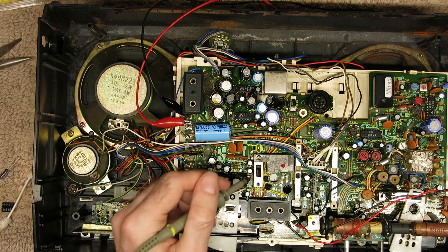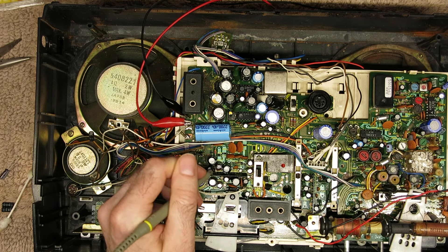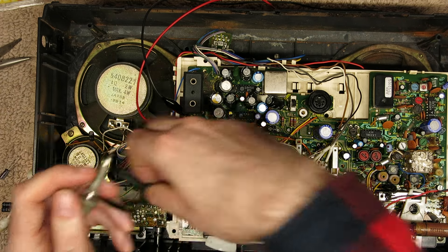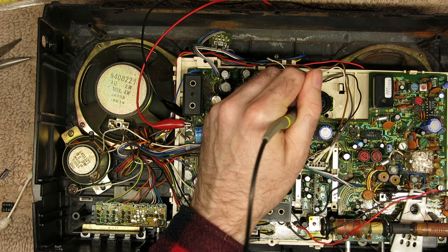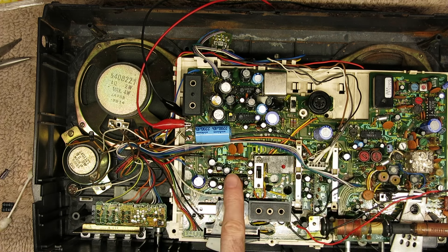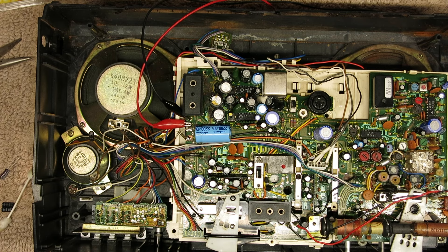A few capacitors have been changed. Previously left-left sounded equal, right-right sounded progressively worse — well now the right side sounds much better. Moving the ground point confirms the right channel is improved. The outputs at the DIN connector now — left and right — are even, so the line stage is working correctly. That's good because it means this IC is fine and I haven't got to worry about finding a replacement, which was a real concern.